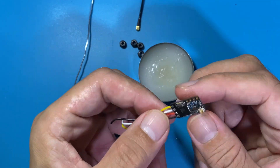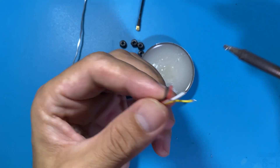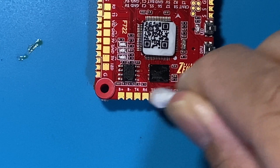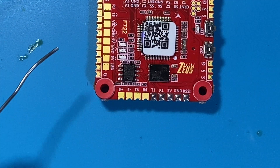I just realized what these connectors are for — LED connectors for arms one, two, three, and four. Of course there's also one that goes to DJI and a couple of other things. These guys think of everything. If you're building race quads and going to races, some races do require LEDs to be mounted on your quads, so this just makes it a lot easier. Amazing! Now I'm going to wire up the TBS Crossfire receiver — the Crossfire Nano SE. Don't forget to flux the wires, tin your wires, and flux the copper pads.